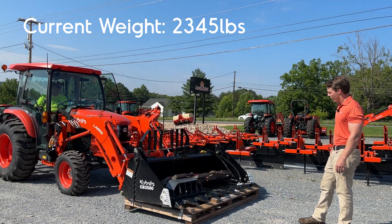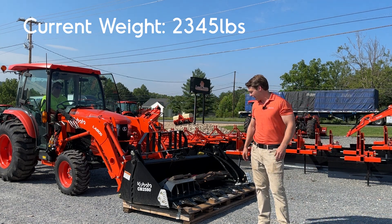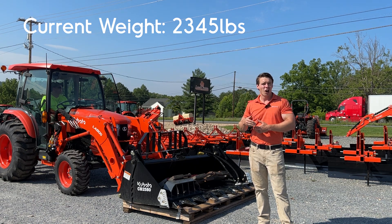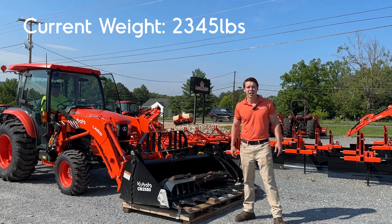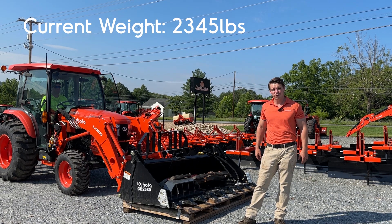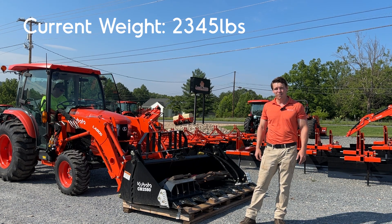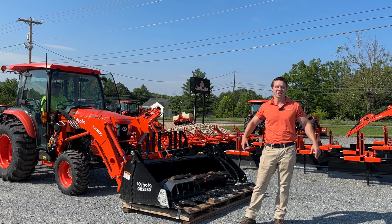We're going to call it about 2,400 pounds of lift capacity today. I could throw Leah on and add another 120 pounds, but we'll call it around 2,400 pounds. If you consider that it's rated at almost 1,300 pounds at 20 inches forward, and we're using 48-inch tines pushing the weight 48 inches forward, that's more than double what it's rated for. That rating is for all-day, every-day full-lift use, but Kubota under-rates their loader performance. So if you're looking at a new L4060 or 3560 with this loader, make sure you have your counterweight and throttle up — but if you need to move a heavy-duty 5x6 round bale around the property, you probably could do it. If you have questions, ideas for other videos, or need more information, leave a comment.